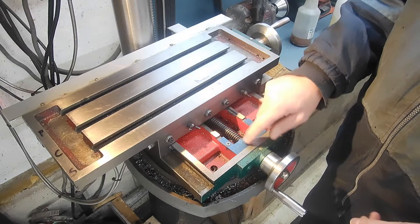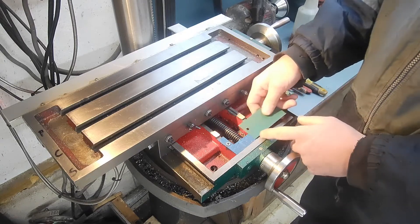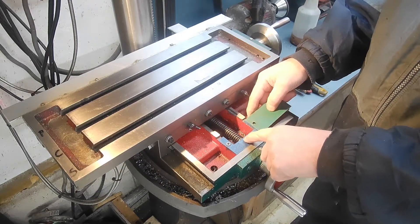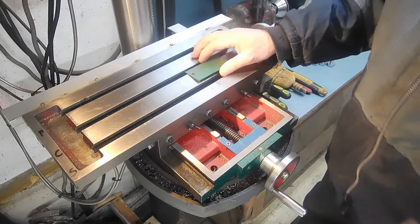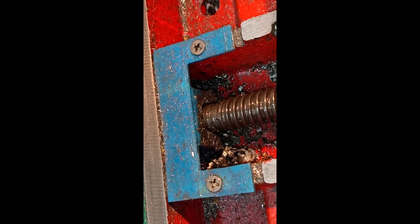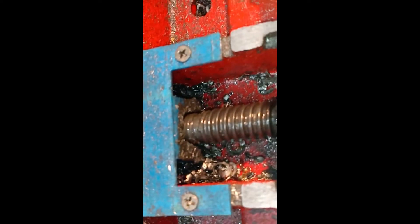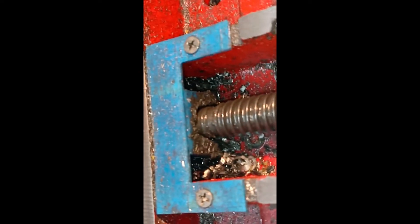So I designed a replacement in FreeCAD — it's just 3D printed. As you can see, we've gained a lot of room, and the nut does come all the way back and touch right here; it can't go any further because the bearing is underneath. And on the other side, you can see it's got a cover that comes down over the bearing and goes around the sides too, so it's got much better protection compared to the old one.